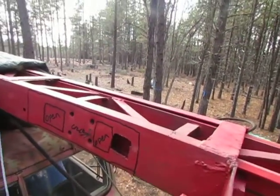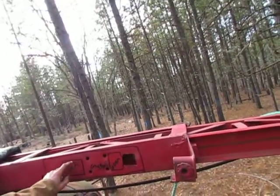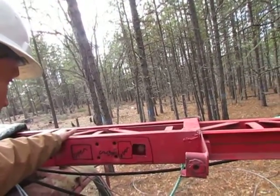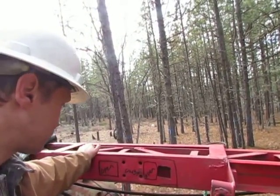My plan of action to fix this is to open this up with my oxy-acetylene torch, being careful not to burn the cable. Knock that swage back up this way and take that whole halyard cable out, go get it tested at Cascade Rigging, and make sure that's still good.